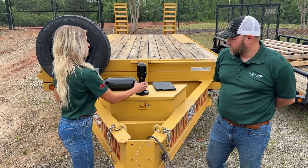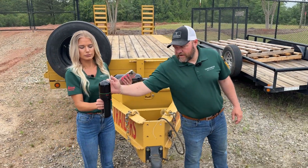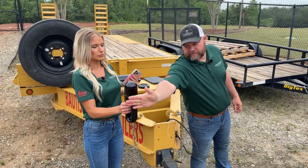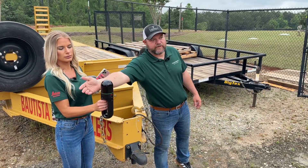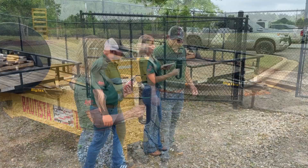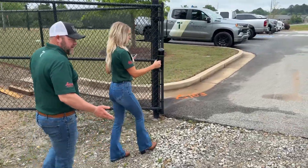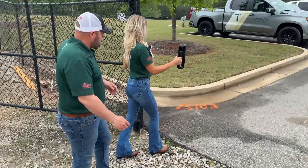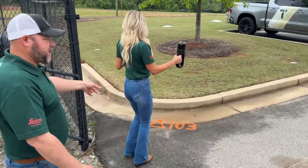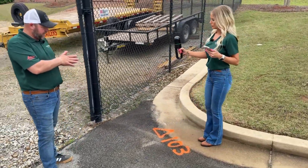So you're going to pick it up and face it away from you. You've got cameras on all three sides — a 270 degree field here and a 360 degree field up top, so it's actually getting things above you as well. If you just walk, you're collecting 400,000 points per second, which is an enormous amount of data. As you come to a ground control point, as long as you've got good ground control points, you can take all this point cloud data and move it to your real data on site.